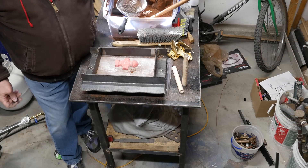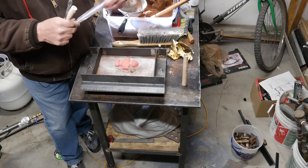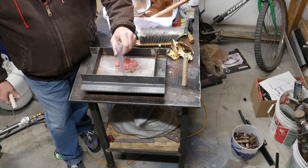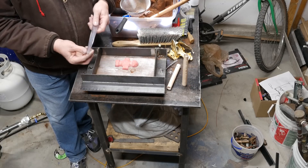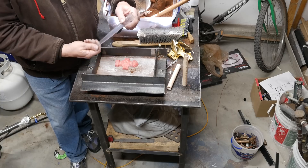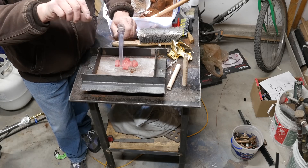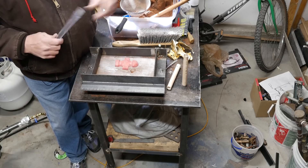Here's what we're going to do. First thing is I've been told I need to have a choked sprue. So this is what I'm going to use — my wife's turkey baster. She'll be thrilled when she finds out. The idea here is that as the mold fills up, this choke will limit the amount of bronze coming through to an even flow. So I have basically a reservoir acting as a buffer as I'm filling, and my lack of pouring ability isn't going to affect how the metal flows into the part.